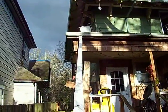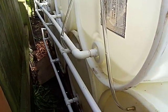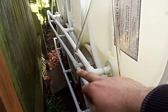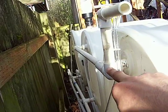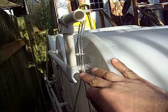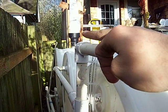The downspout comes down and fills up the top barrels; the top barrels fill up to the bottom line and then fill up the bottom barrels. The air vents out of the bottom barrels through these tubes, and the water backs up all the pipes and fills up to the top line. I raised this up higher than the top of the barrel so the top barrels fill up all the way, not just to the top line. This point is a little lower than the intake so water won't spill out the intake.